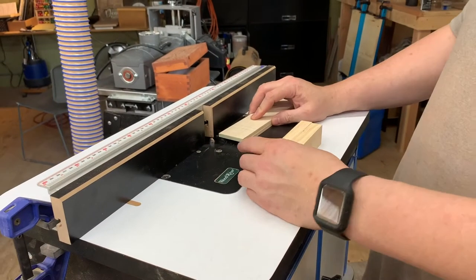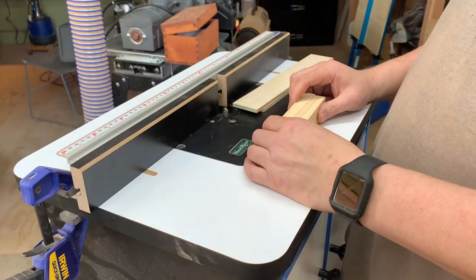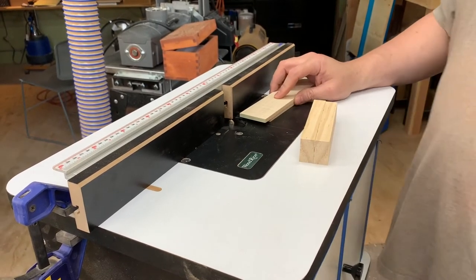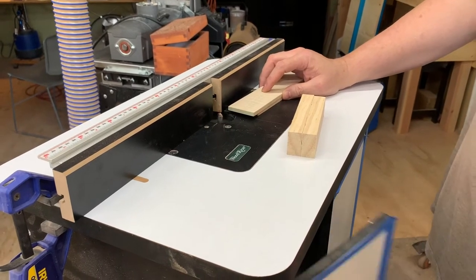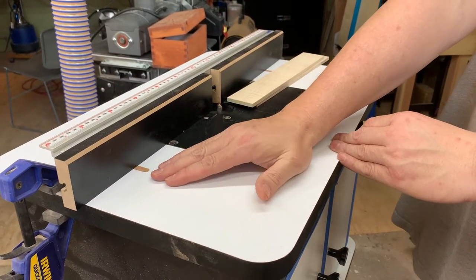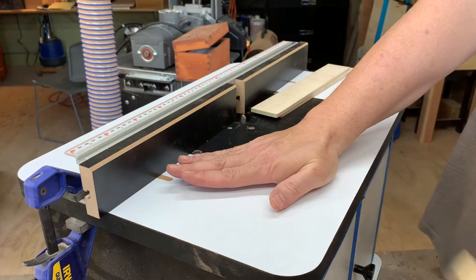First thing I want to do is, I know that I'm cutting trenches for a half inch dowel. So roughly, it's going to be a quarter inch high, though we want it a little lower than that because we want to leave a tiny bit of gap at the back of this for when the wood moves. Because if it does this, it'll still touch at the front. But if the lid moves in this direction and we didn't leave any gap at the back, then it will gap at the front when it closes.